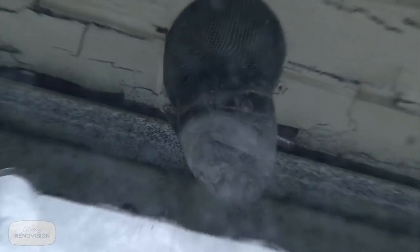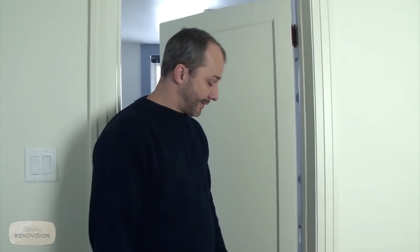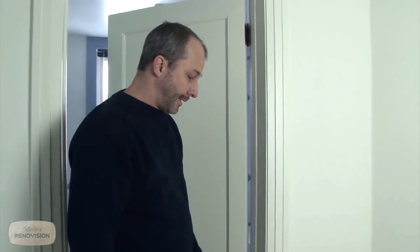Welcome to Pat and Gilles — a great little project. We're in old Ottawa, a 1930s home. Pat and Gilles have had a couple of renovations: they've redone the main floor and the kitchen, and there's an addition done in the late 50s. The house has unique roof lines, bad ventilation, carries a lot of snow and weight. We've been asked to come in and do a bathroom renovation. The big question on our minds is the condition of the flooring underneath. There was a lot of transition in the 1930s with the spacing of joists and direction of the wood, and tools were used to make room for plumbing. The floor really caves in toward where the tub is — we're not sure if that's a plumbing or a load-bearing structural issue. Either way, we're looking forward to opening the floor to find out.